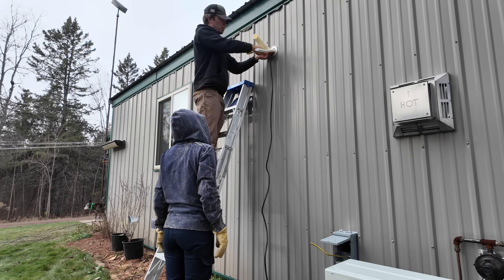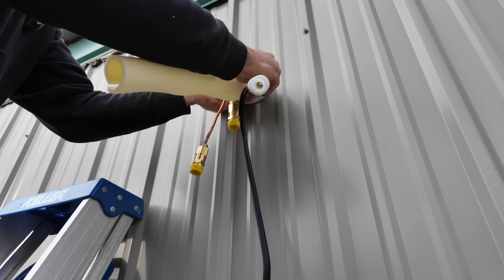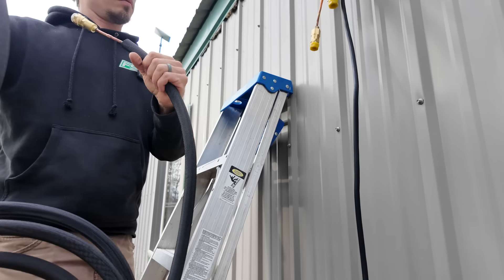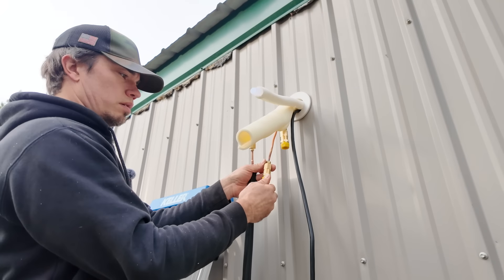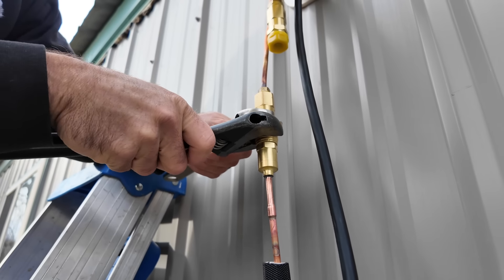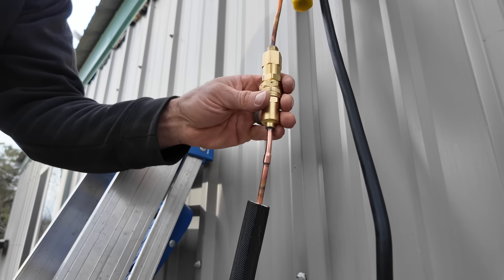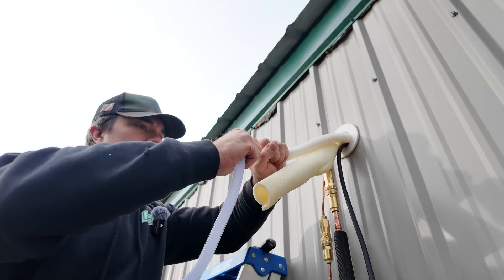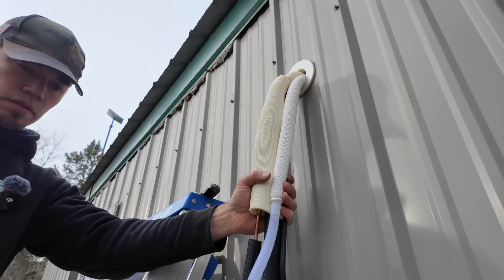These need to come down gently — careful not to collapse these. There's a drain hose that goes on here. And when you get all this together you wrap it in this tape stuff that makes it look nicer. Oh, it's got nice little o-rings in it. I'm sure somebody watching this is going to freak out because I'm using speed wrenches — get over it. There's always somebody. This is sufficient, and because there are o-rings I don't feel the need to crank on it. Retainer clips so that they don't back out — that's pretty clever. Just kind of snapped over that groove.